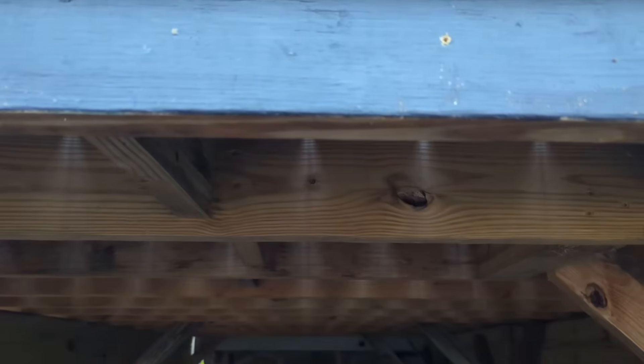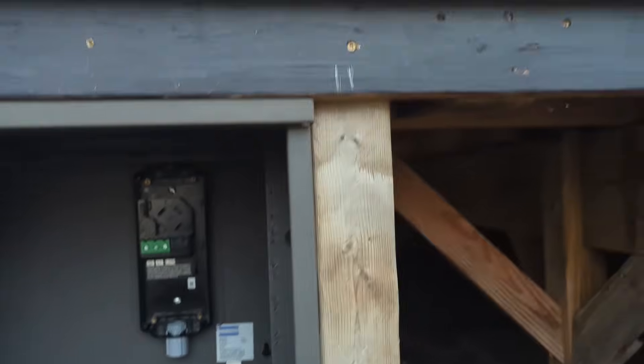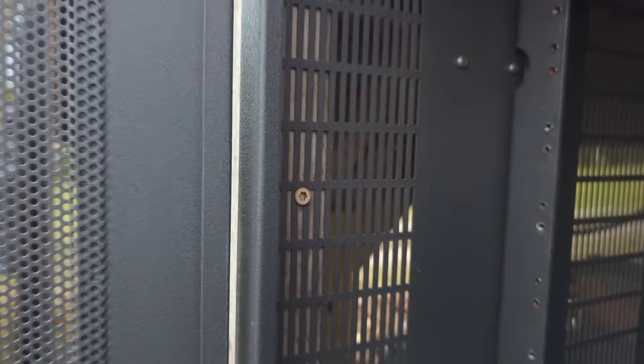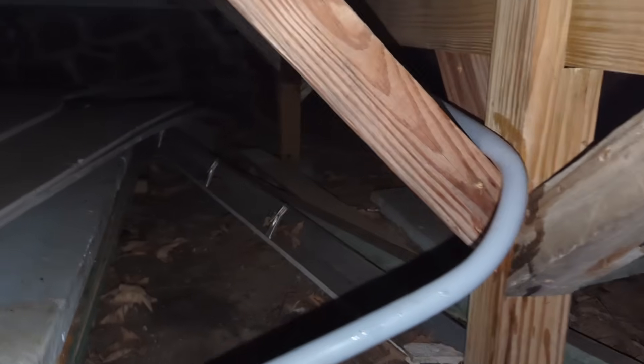The plan is to mount the metal cabinet under the deck right here. I'm currently working by myself, and this is how I was able to mount it: I'm using four pieces of 2x4 attached to the deck on each side of the metal cabinet, and from the inside of the cabinet I screw into the 2x4s. It got dark on the first day — I only had one more bend to make for the PVC conduit.